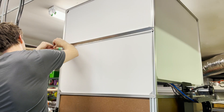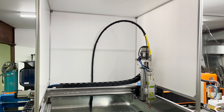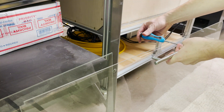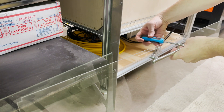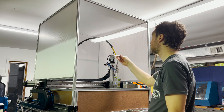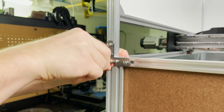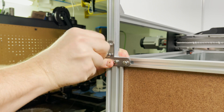I get the aluminum angle installed to keep the optical cable from bowing out the back panel when the cutting head is moving around. I bought some acrylic panels for the front door and use my CO2 laser to cut out holes for the hardware. I designed the handle to fit and slide inside the channel of the 2020 extrusion, and then get it attached to the acrylic.